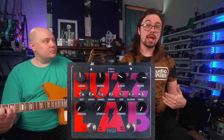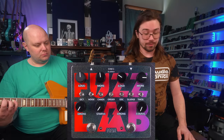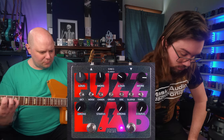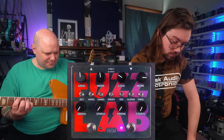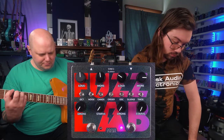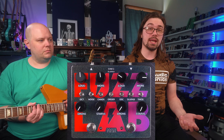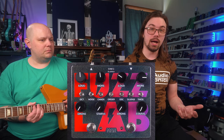Down is actually a bass boost, whereas up is the stock configuration. Middle toggle switch is the sludge toggle. That changes the biasing of the different gain stages and also makes it more act like a Torn Speaker Anima.